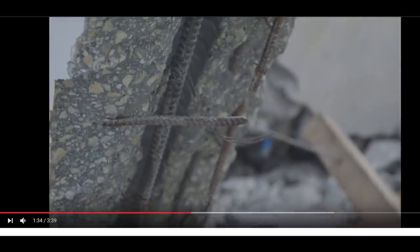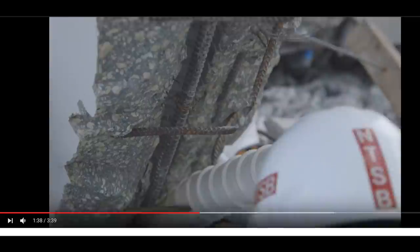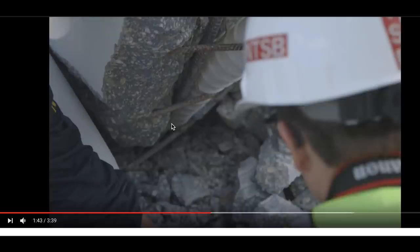But significantly, notice where this post-tensioning cable is. Number 11 goes up like this, right? Diagonal. And this would be the underside, and this would be the topside, the sky side. The underside is where this cable is in relationship to the number 11, how it's embedded. Now, I'm going to just go up to about 223, but you're going to take note of right here is where the rest of this cover would be. This part would go there. Let's say this rib part matches up with that rib part. The balance of that cover is about 3 to 4 inches. So it was not centered at all, this cable.